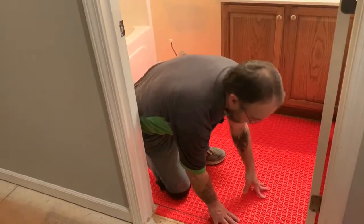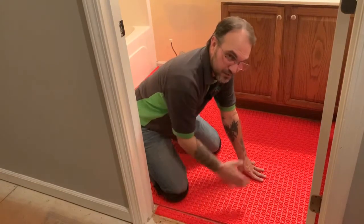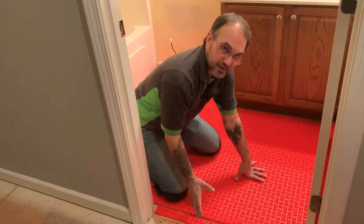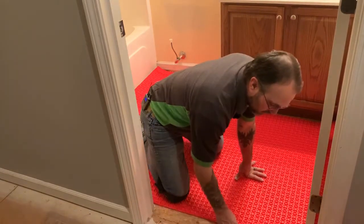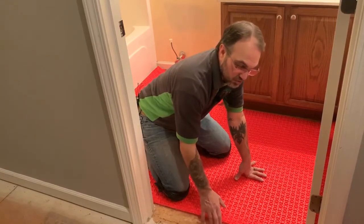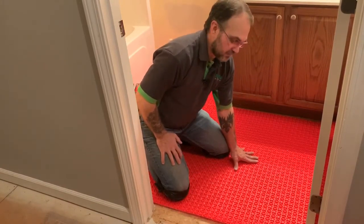Before you put this down, we've got to pull this up and then sponge our substrate. What that's doing is wetting the wood just a little bit, but also cleaning up any kind of dust that may still be on it. You want to make sure that you have a good bond from your mat and your waterproofing membranes to your substrate. If there's any kind of dust, it may not get a good bond with thinset to your substrate. So let's pull all this up and I'll show you.